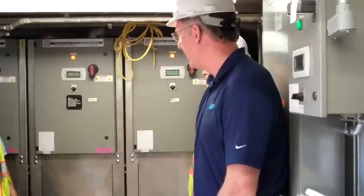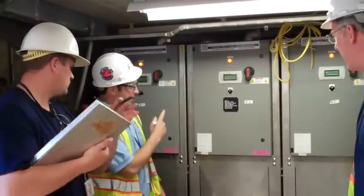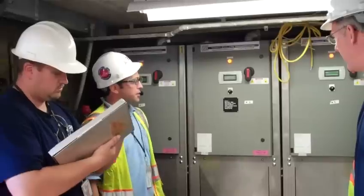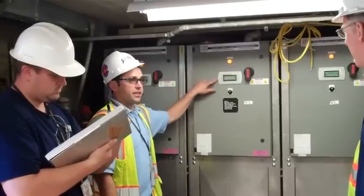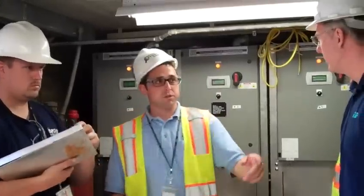What we have here is the Tandem Chiller — three modules with two scroll compressors each module. We have the module interface here, controlled by the remote master. All three modules are controlled from here.